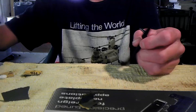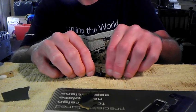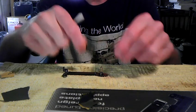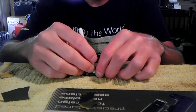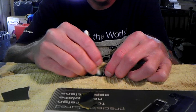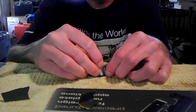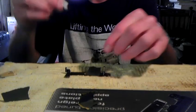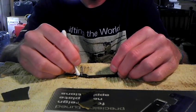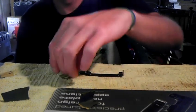Getting around the pin area is hard with just a piece of paper and does take some time. One tip I use is to take a piece of sandpaper and use a Q-tip on top to give me my pressure — kind of use that to sand. It lets you get your clumsy fingers out of the way, get a little closer to the actual pin, and still keep even pressure on it. This is a little tip to make that area easier, including the front. It does take some time but I don't think you need more than an hour.